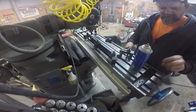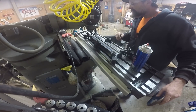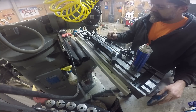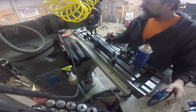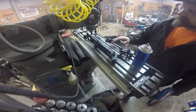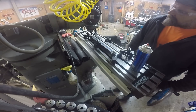I just went this far and thought you were running. I did get it on another camera somewhat from a distance. Like I said before, I tried this on the shaper. I don't have the rigidity with the tool holder, so I need to come up with some tooling for my lantern post. I need to get rid of the holder and just put the tooling in the lantern post. I was getting a lot of chatter — it was cutting fine, but it was just skipping, chattering real bad. So, back over here on the mill.